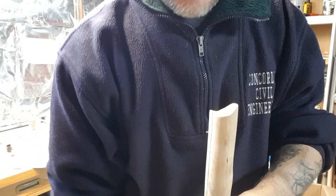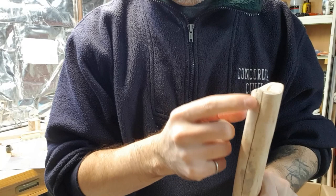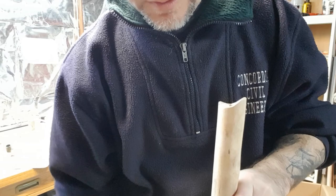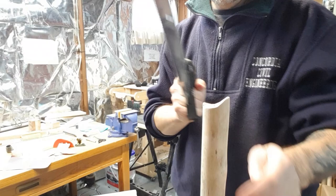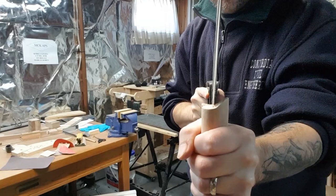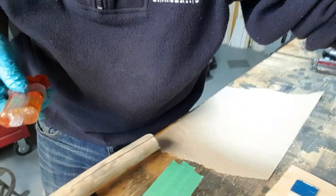So we've got that form drawn out on top with the cut. What we're going to do now is make a few notches — little cuts across a few other faces — to give the epoxy something to bite into. We're going to clamp it up and just simply with a saw make a few cuts.